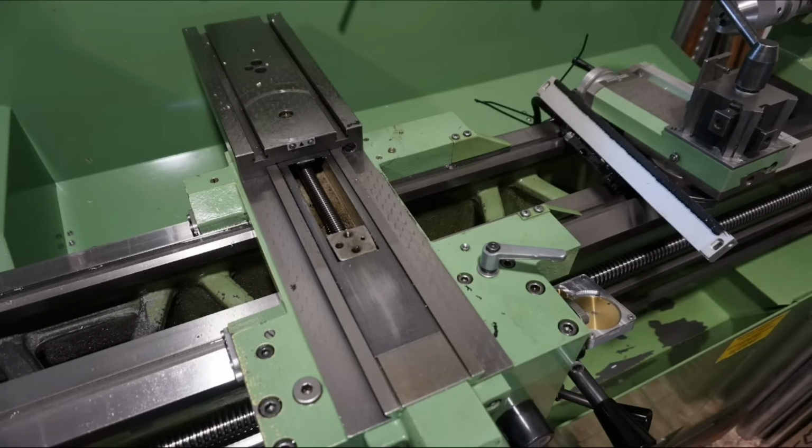And at this point of the project, I made a call that I didn't want to add fittings and lines for the lubrication system up here at these ports and route the lines to the back and such, or even worse, a fitting here and routing lines to the back, because all of this would be a big obstacle in the working area. These lines would collect dirt and chips and would be difficult to clean. So rather, I wanted to have all the connections for the bed slide lubrication on the back here, hidden out of the way of the work, so that eventually this modification would be an upgrade and not just a, well, change.